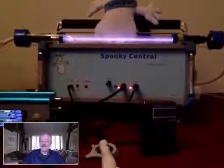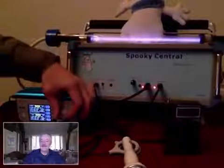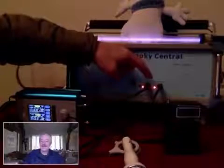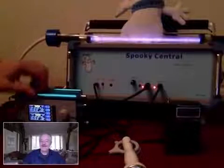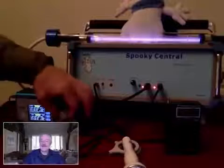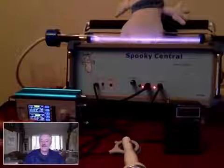Can you see the generator down here? So perhaps you can see that the number at the top is what I'm using as a carrier, which is the input, and the modulations are on the right here. But it can be run without modulation — it's up to the user. Currently it's running at 3.2 MHz. I'll introduce the modulation into it, so it's running at 300 Hz modulation.